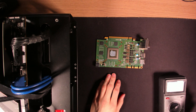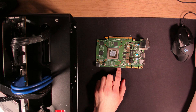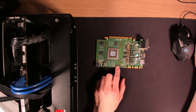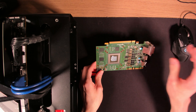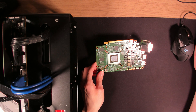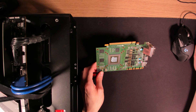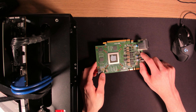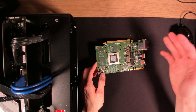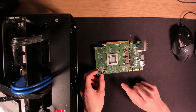Let me do some quick research. The GS7103 is a 3 amp ultra low dropout linear regulator. I think that's my issue. Maybe the feedback is messed up, but I don't expect that — dead feedback circuitries are kind of rare; I haven't seen a whole lot of them. I also just realized I skipped checking 5 volts altogether, but I'm assuming it's working since we have V-core and memory. I'm going to go with a dead GS7103.